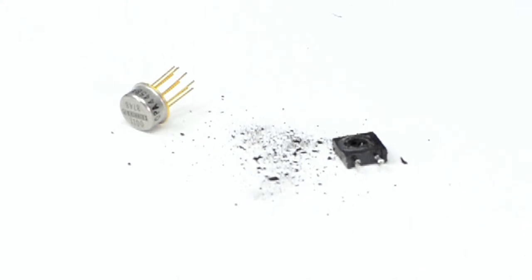So my working theory of what happened is that because of some charge or ESD zap on the terminals when I was swapping resistors, the current source got damaged, so that opamp either latched or got damaged internally. So the full power rail was connected to the resistor network, the resistor chain, and because the power is high enough, that caused that 100 ohm resistor to burn out. And whatever I was doing afterwards was just not working properly because the damage was done.